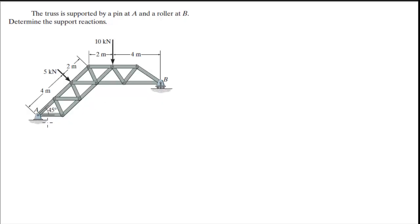You know that you have a reaction at B and you have two reactions at A. Since B is a roller, it can only have a vertical reaction BY. And A is a pin, so it has a vertical and horizontal reaction. The horizontal reaction is going to be going to the left, because this 5 kN force is going to the right and there's no other horizontal force. So let's call this AX and this AY.